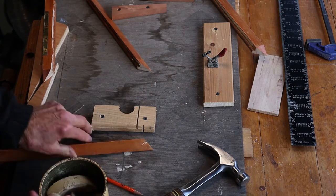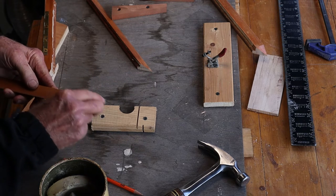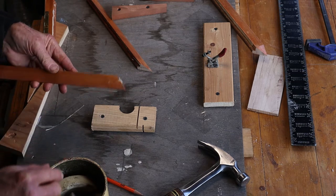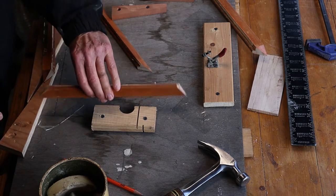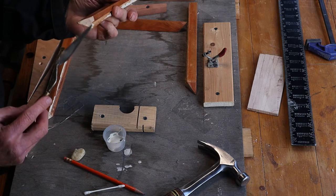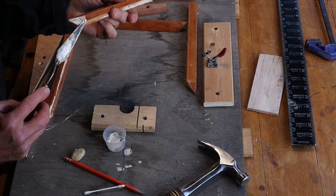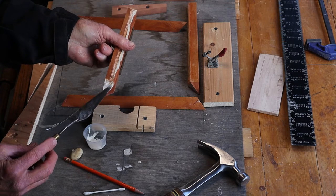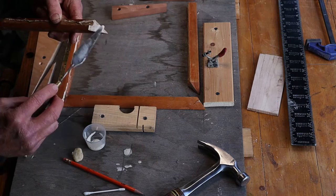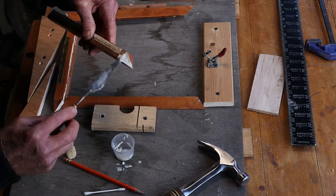I'll put a little packing tape down so glue that squeezes out the bottom doesn't stick. And I'm going to wax the ends of the part that will be facing down — just leave that wax on there. Any squeeze-out should come off pretty easily. Now I have to be careful to keep the glue on the surface and not let it bleed over onto the waxed area if at all possible. Judging the right amount of glue is kind of tricky, but this is how I chose to do it.